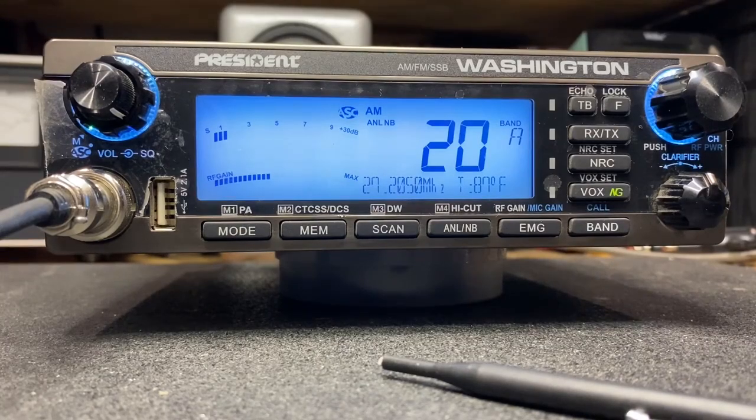We know we'll have a high SWR if we have long beeps with a lot of space between them, and again as we zero in back towards that one-to-one SWR the tones will be more frequent, and then when we get the solid tone we will be tuned.